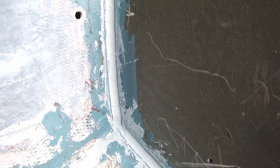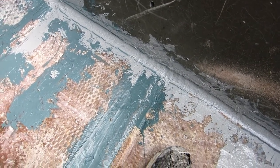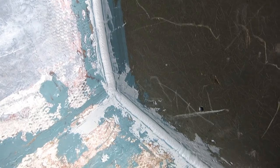So I did a lot of epoxy this morning, put a big fillet so we could get some good strong curves. Use an empty plastic caulk tube, works really well for getting this curve. And let it dry, and I guess tomorrow I'll do a lot of sanding again. It won't be as nasty because it won't be fiberglass, it'll just be dust.